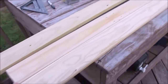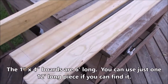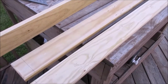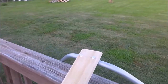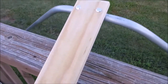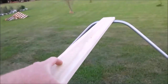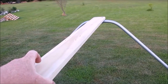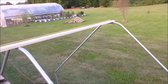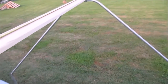These two boards are going to go across the entire top of the greenhouse. I got one extra one-by-four for the sole purpose of joining these two pieces and the side pieces together. I've joined these - you can see where I've tightened them down. Now I need to put another rib on at the appropriate distance, which is about four feet from the first one. These two ribs are joined and they're about four feet apart.